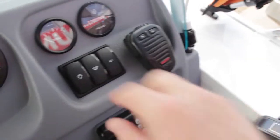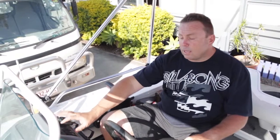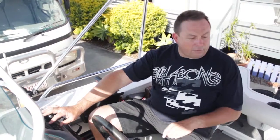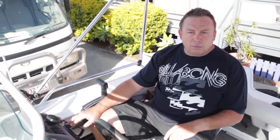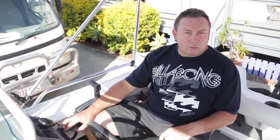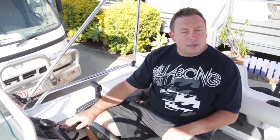We then have our three switch panel here. We have the navigational lights, which we'll talk about in a sec. We have auto bilge with manual override. We also have a live bait tank in the rear in this model, and a spare switch. We have the VHF marine radio - channel 16 for emergencies anywhere in the world. If you're in trouble, it'd be good to do the Marine Operator Certificate of Proficiency, the marine radio license. Knowing the language, what to say, when to say it, and when not to say anything is really critical in a rescue.